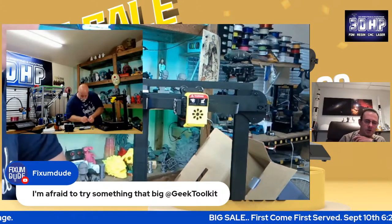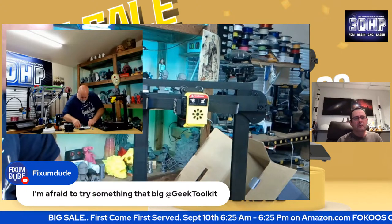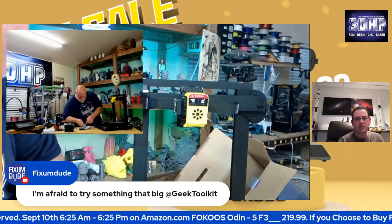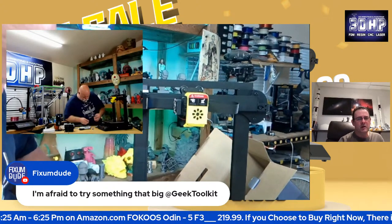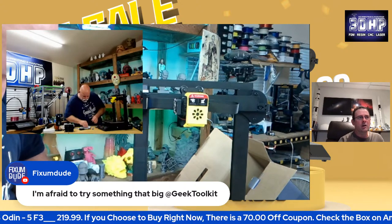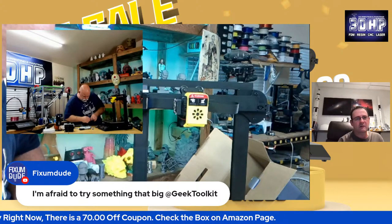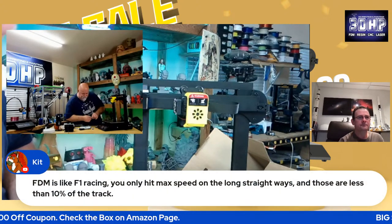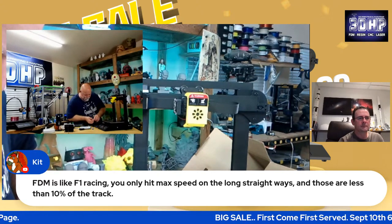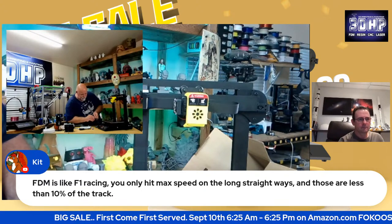I've printed with a 1.2-millimeter nozzle. I've done PETG with a 1.2 nozzle and it prints fine. The quality of the print depends on your layer height more than anything. It does minimize the amount of time you're spending on walls, so it does speed up the prints. But it all depends on your hotend, whether you can melt it — you often have to go much higher on temperature. On PLA, typically on every machine, I do 210 degrees and 60 for the bed. PETG, TPU, things like that are different settings.